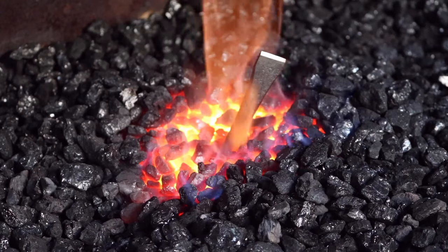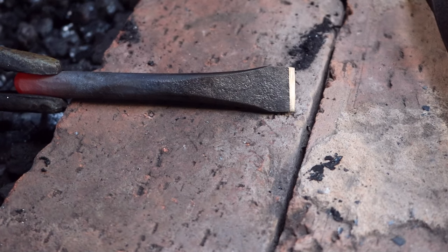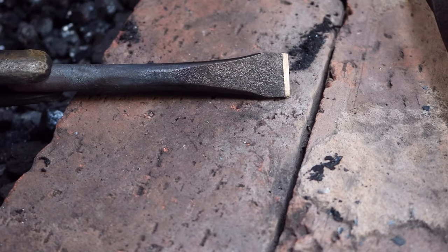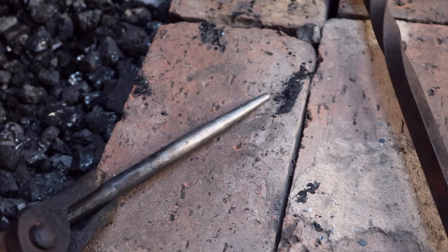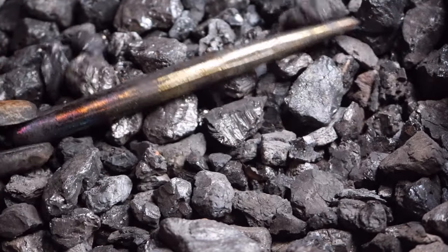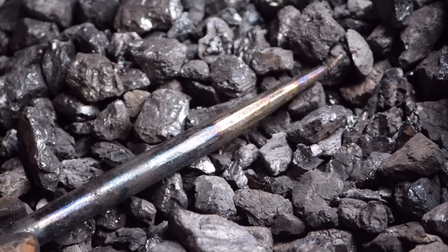So I'm just going to target the thicker ends of my tools here. The back end isn't hardened as much, and it doesn't matter if we soften it — it's all about the working end. So I'm going to be gently heating up the back end to allow the heat to travel down to the working end. We are dealing with much lower temperatures here, only around 200 degrees, so we don't want to put the working end in about a thousand degree fire and end up overshooting. Although, if that does happen, don't worry — simply rewind to where I was showing you how to harden and try again. The reason we cleaned up our tools here is because we wanted to see the colour change. We don't want any oils or dirt stopping us from seeing that fantastic golden colour at the end of our tools. The colour in the steel will indicate how hot it is, and therefore how tempered your steel has become. You're aiming for a nice golden bronze colour. If you overshoot into a purple or a blue, don't worry, it'll still work — it just may end up being a little bit softer than perhaps it wants to be. But on the plus side, it's a lot less likely to crack.